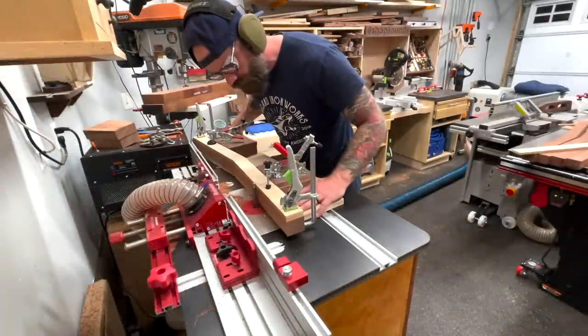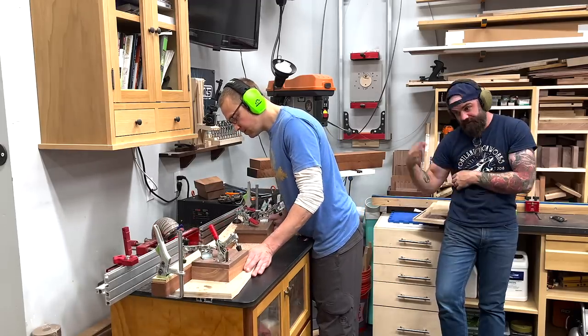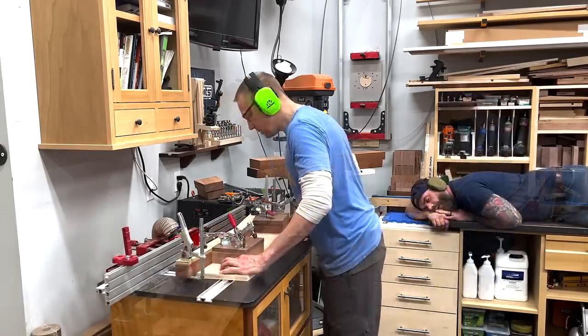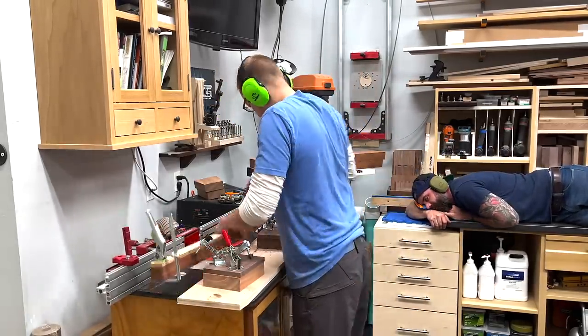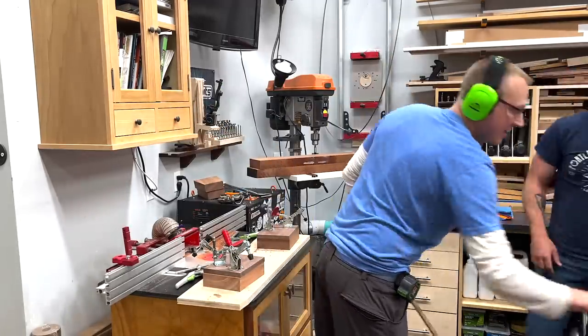As you can see, I'll make the first pass on this side and then it's just a matter of unclamping the toggle clamps, moving it to the other side and adjusting these little ratchet clamps. The key is to never take the template off of the part — always keep it clamped in one way or another. Jason was kind enough to help flush cut a few pieces; however, apparently this was too slow an operation for the Mothman and he got quite bored, took a nap. Being the hospitable person I am, I got him a nice pillow of microfiber cloths and went back to work. That's going to do it for us on day one.